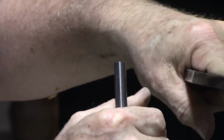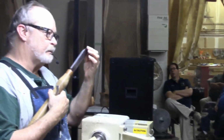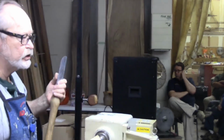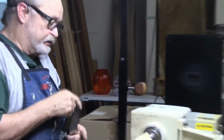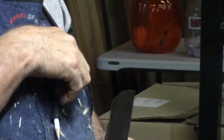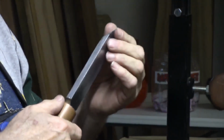If I'm removing bark on a bowl, I don't want to sacrifice a sharp edge on a bowl gouge, so there I pull up a pretty heavy burr. That's giant to me, okay? But if I'm doing finishing work, and the best finish I've never seen topped, Del Stubbs did the first video ever, I think, commercially, in woodturning. His finishes were, you know what he did? He did burnished burrs.